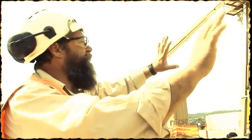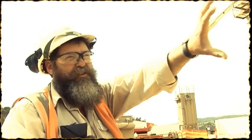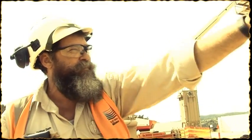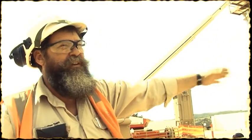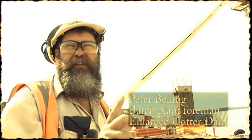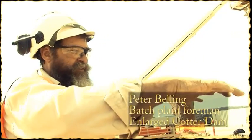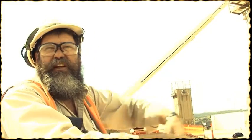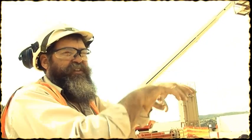What you see here now is only half of the setup. This is one batch plant which can run by itself, but we'll have another one come in and set up perfectly beside it — we'll mirror this one. They'll run side by side and we'll control them with one computer system. So when one plant's batched its load and drops it on the conveyor, the other one will be batching its load — a continuous feed of concrete.